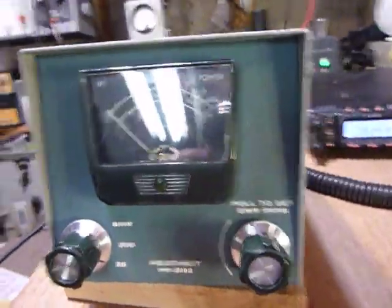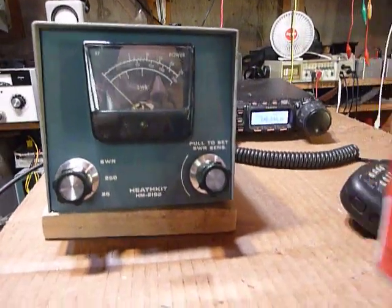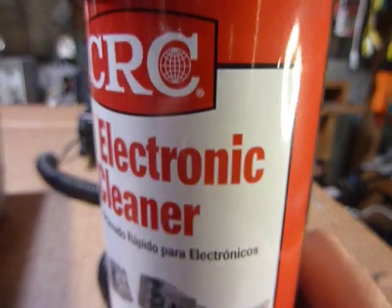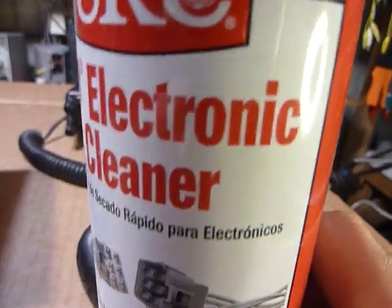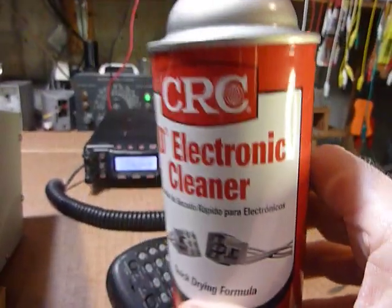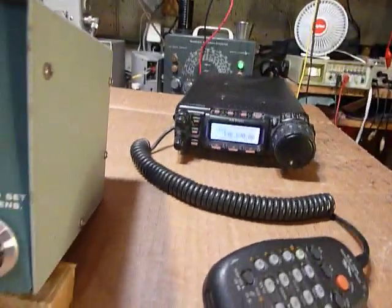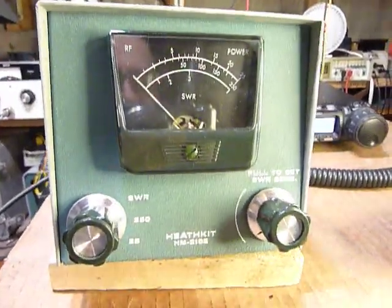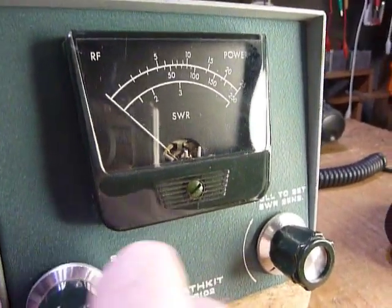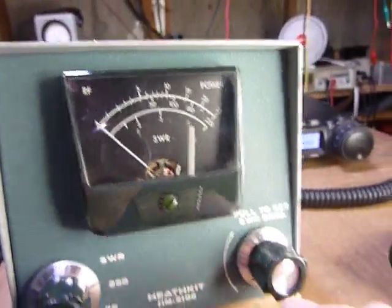The cure for that of course is to clean it with good contact cleaner. I buy CRC electronic cleaner at Walmart in the auto department. You get a big can and it's really quite inexpensive compared to DeoxIT, which is about $15.95 for a tiny can. I think this stuff is just as good. So I sprayed both switches and then worked them — each one 25 times. And everything is working fine.